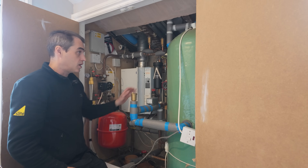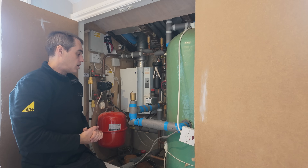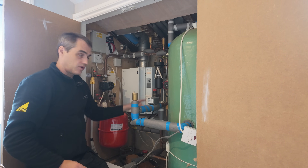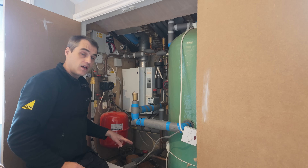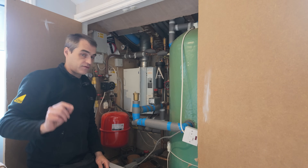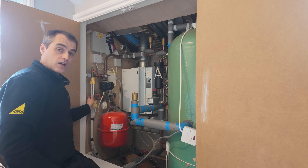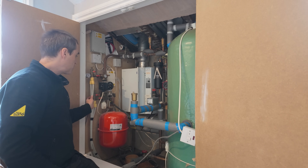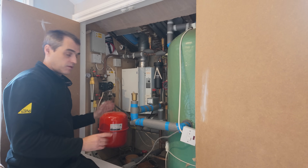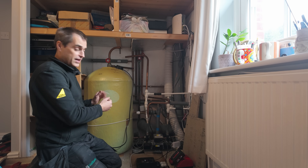In the bathroom at the back of the house we have a heat-only boiler on a sealed system and one of the vented cylinders. There's another vented cylinder in the other part of the house. Importantly, there are two sets of flow and returns from the boiler — one for central heating in 22mm copper, and another flow and return going to the cylinder on the other side of the house, still on the first floor. We also have a microbore underfloor heating setup to figure out — we might keep the circulator and create separation on the primary pipework, or just run it direct.